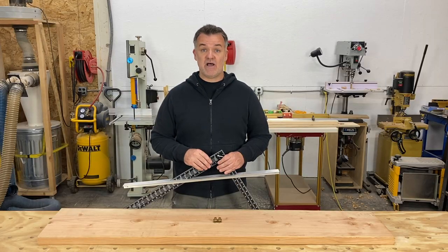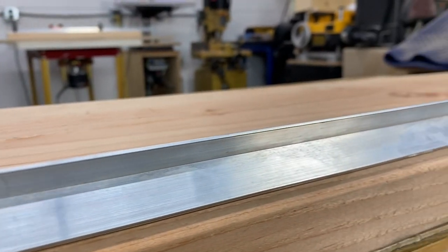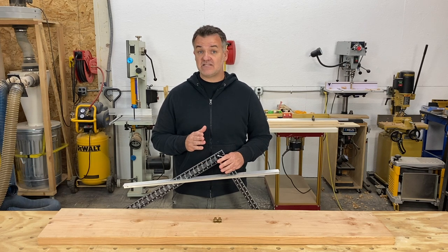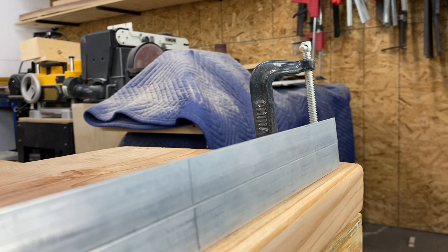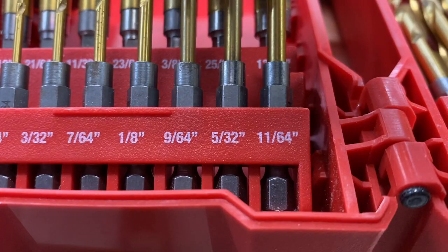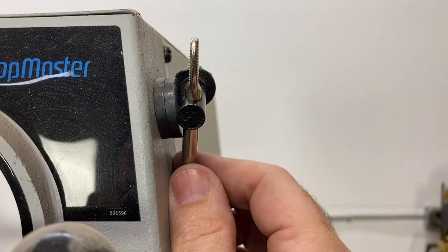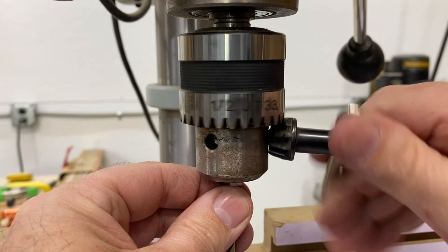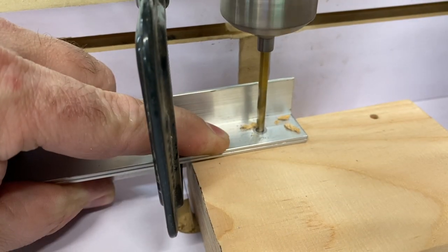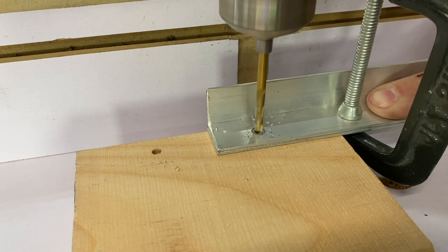Start by cutting your aluminum angle so you have two 31-inch pieces. Next you need to drill three holes to accept the 6/32 screws. It's very important that both aluminum pieces are perfectly flush on the face before drilling. Use small clamps to ensure it's perfectly flush. Select the drill bit that will give you the least play — if you're using 6/32 screws, you want to use a 9/64 inch bit. Drill the holes; this is best done on the drill press but you can do it by hand if you're careful. Make sure you have a wood block under the hole so you don't bend or twist the piece while drilling. Drill one hole in the middle and a hole 14 and 3/4 inches from the center on both sides.